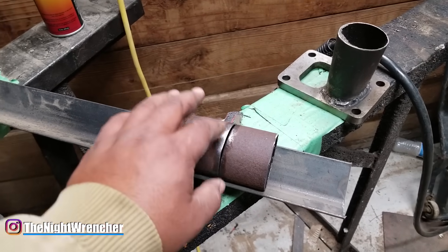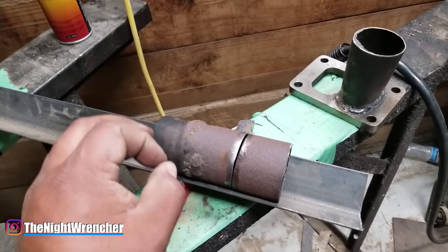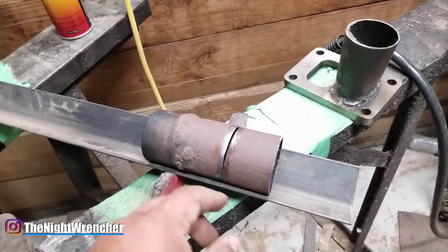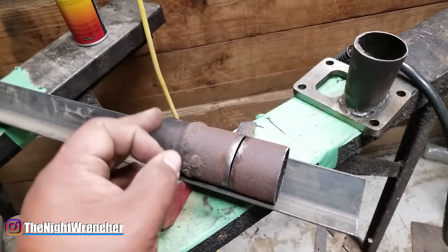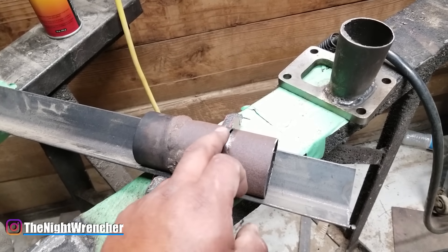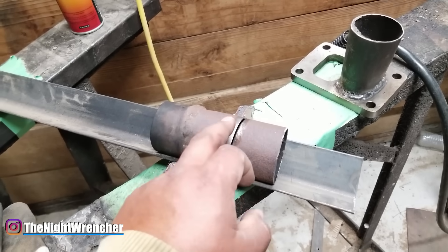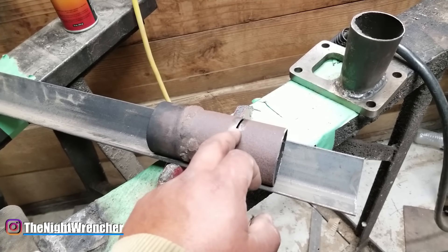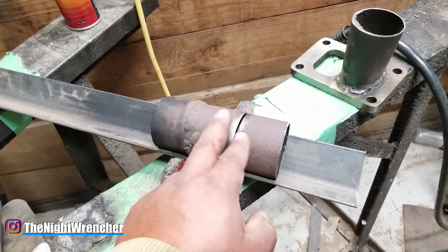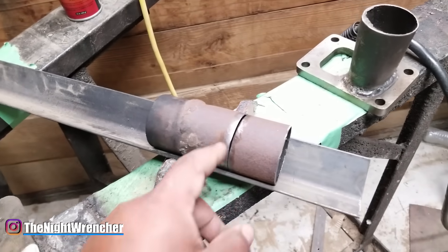There are several big points when welding thin metal. The first is that the surface becomes extremely important. When you are welding two similar metals together, people always say to clean your metal before you start welding. That becomes extra crucial when you're welding older or thinner metal because every arc that you light on the steel will matter. Every point of contact will matter. If you are struggling to get the spark lit, you're going to start poking holes, damaging the edge of the material, and you'll be dumping more and more metal into the pipes.